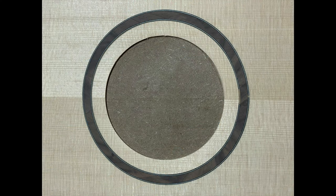Here's the final result. I think the purfling on either side of the walnut ring just adds a really crisp detail to the overall rosette. From this picture it might look like the sound hole is slightly offset from the rosette, but this is just the angle of the photo. With the CNC machine you get really precise cuts, and by drawing all of this in Fusion 360 the first time they all have the same center point, giving you a nice accurate circle. Thanks for watching.